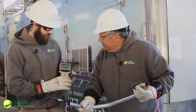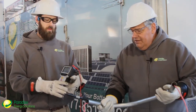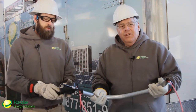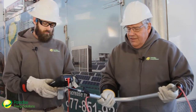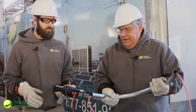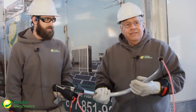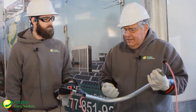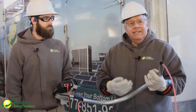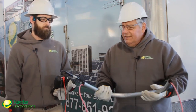What's our result? We're seeing over 100 gigaohms. For standard commercial performance, one megaohm is considered satisfactory, so 100 gigaohms would be considered a completely acceptable test — and yet we know that there's a piece of damaged insulation in here. That's because the exposed copper is not able to touch the metal, and that's often the case for new installations.